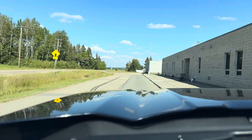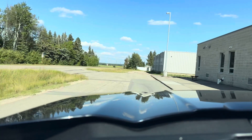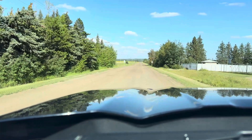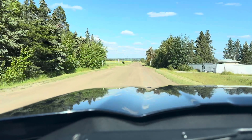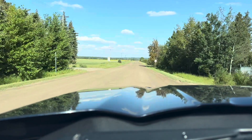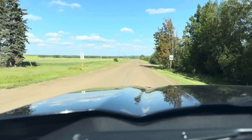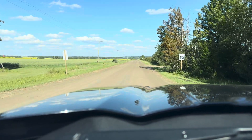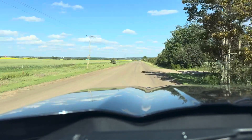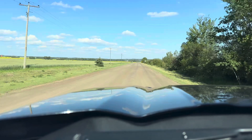I've got the phone propped up on the dash so I'm not holding it while driving. Okay, we've got some noise here. I'm just going to drive past to make sure it's not multipath — if it is, you'll hear the noise fade in and out as you're driving. I didn't hear that, so I think it's really close to that spot. I'm going to turn around.